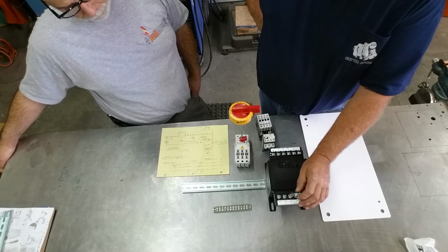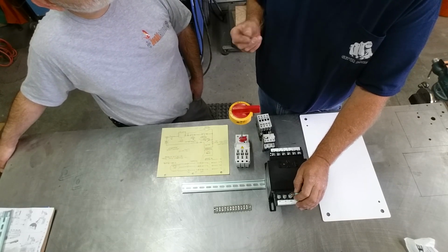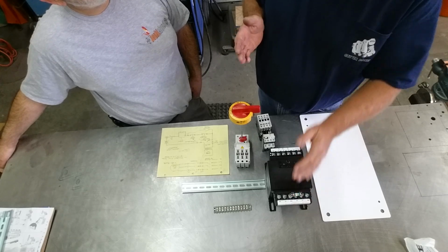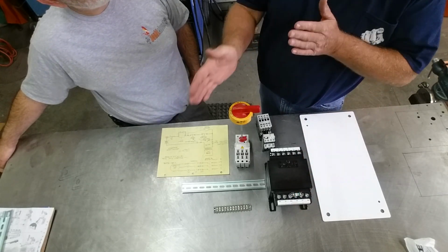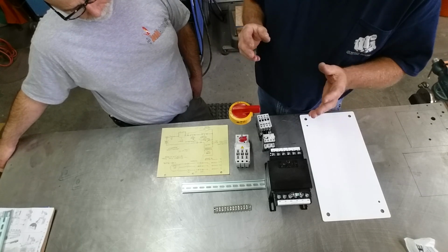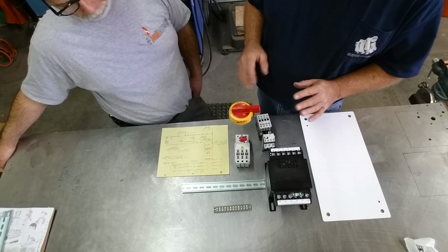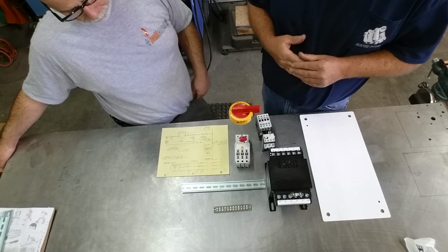Yeah. And there's another phenomenon known as phase shift that happens when you start running little incandescent light bulbs and things like that. If you don't ground that neutral, it's sitting there alternating, trying to find one. So you get flickering bulbs, chattering contactors. There's all kinds of funny little ghosts in the machine that can happen if you don't phase out your neutral.